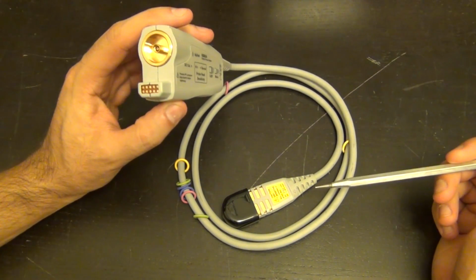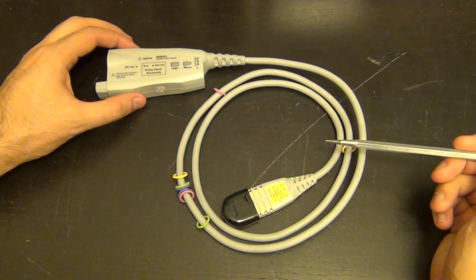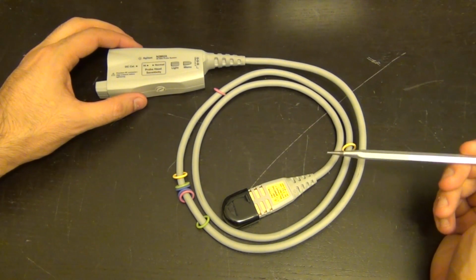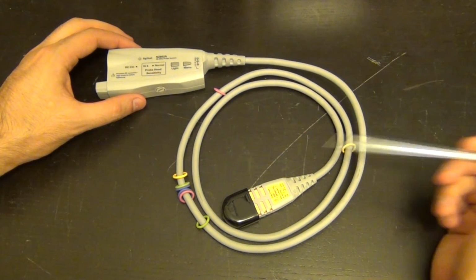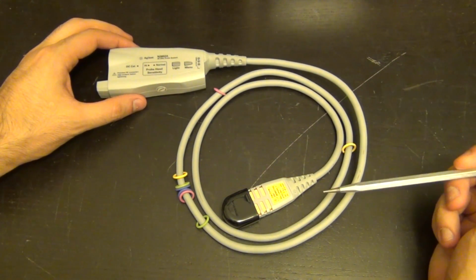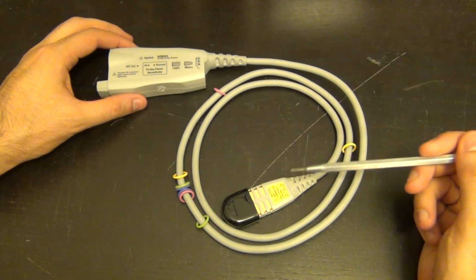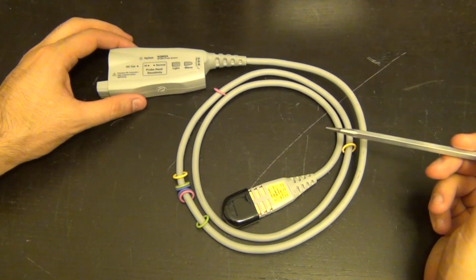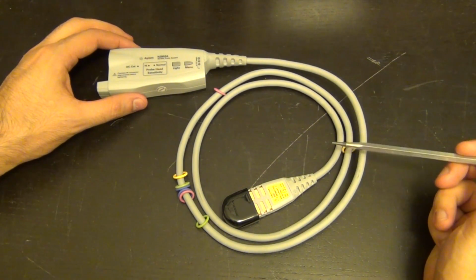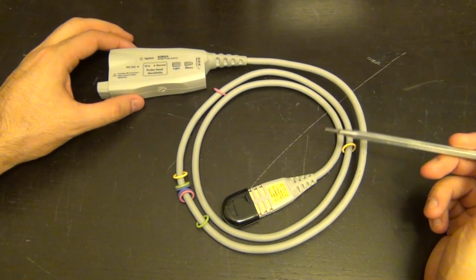Now, if you look at one of my old videos, I did a review, an experiment video of one of the X-Series oscilloscopes, the one that has two channels at 62 gigahertz, a 160 gigasample per second oscilloscope. I highly recommend that you watch that. There's quite a bit of information about what goes on to make an oscilloscope like that. And that actually uses a down-convert mixer to convert into two bands of 33 gigahertz, and then uses two 80 gigasample per second ADCs to sample those 33 gigahertz bandwidths with some overlap, and then doing correction, correlation, cancellation, and so on to get a total of 62 gigahertz of bandwidth.